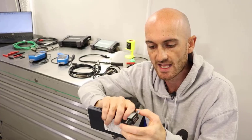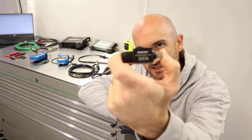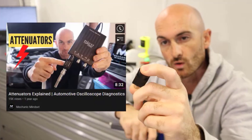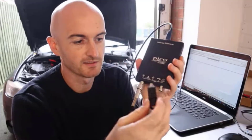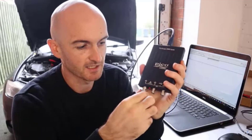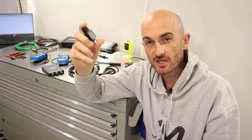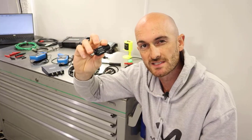So what you will need to get is one of these - it's called an attenuator. I've got a video on what it is and what it does, but basically it reduces that input so that you can put more voltage in without damaging the scope. You can pick up an attenuator for anywhere between 10 and 20 dollars.